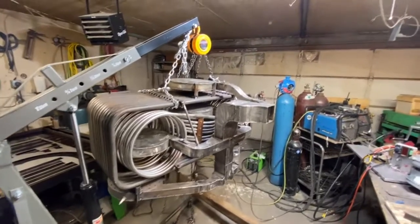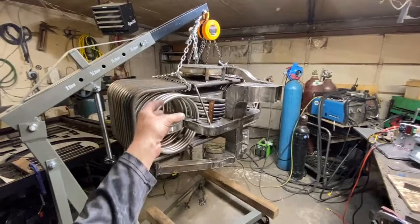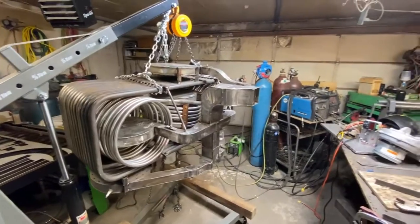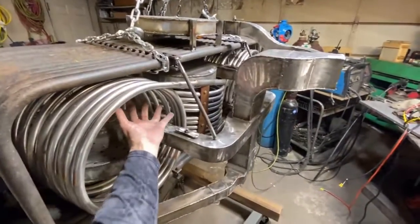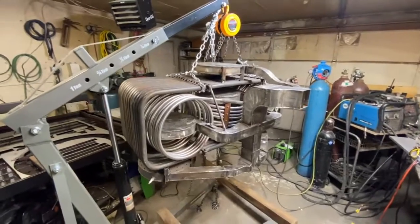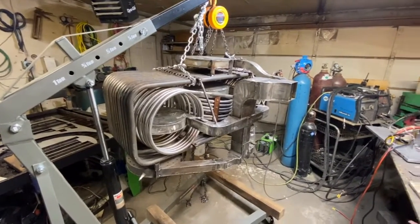150 miles an hour. So that's kind of what we've done here, is we've built a thermal transmission that's going to convert a lot of the BTUs that are wasted in the air and turn it into infrared IR radiation. So a lot more energy will be captured in this area versus a bunch of hot air being thrown out the flue, because air has a very limited heat capacity, but thermal radiation is very powerful.